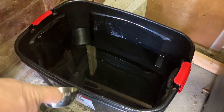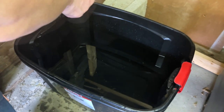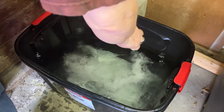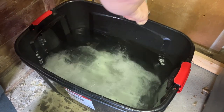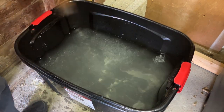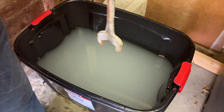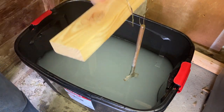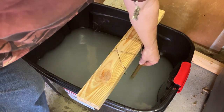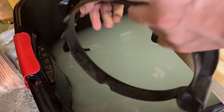we only need about one-third of a cup of washing soda. Too much is not always better than not enough, so we should roughly measure it out. We also need a piece of sacrificial metal. The electrolysis process will cause this piece to corrode while it removes the rust and corrosion from the piece being cleaned up. The negative charge will connect to the cast iron, while the positive charge goes to the sacrificial piece.